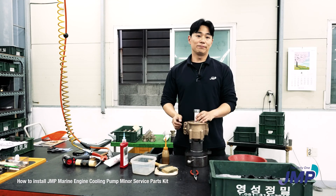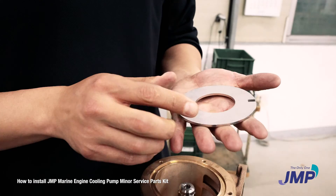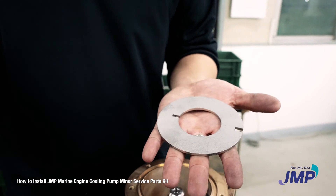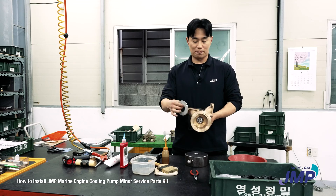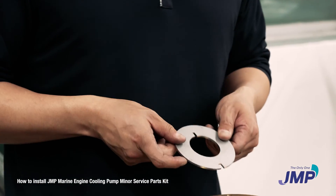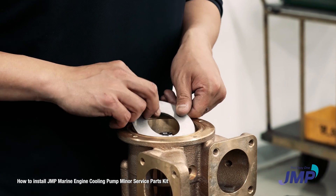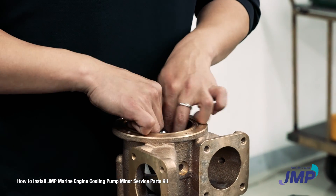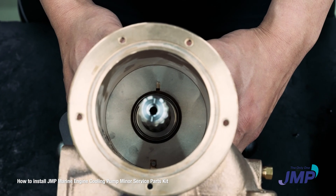Push again. The next stage is the wear plate, and we use the clean surface on the upside. As you can see, inside the pump there is a pin and the wear plate has a groove for the pin. We match this groove to the pin. There is also a pin in the pump case on the bottom.